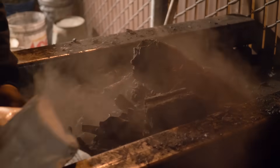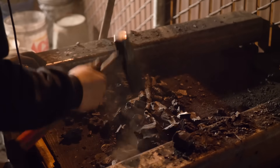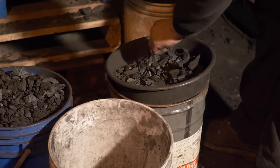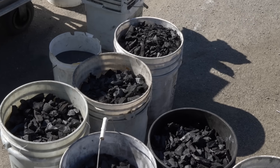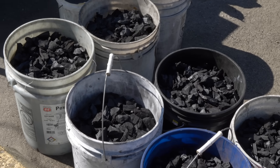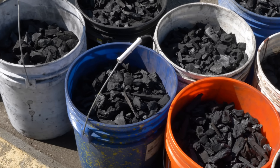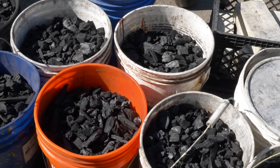The reason this is so labor-intensive is there's a lot of preparation. Before we can start the smelt, we need to break up the charcoal. Volunteers generously lent their time breaking up about 200 pounds of charcoal for every smelt. We're looking for a very specific size — about one inch by two inch, nugget size — because extra-fine stuff would clog the tuyere blower, and big pieces wouldn't combust fully and would make the bloom unusable.